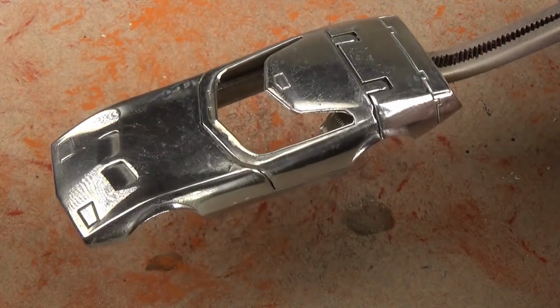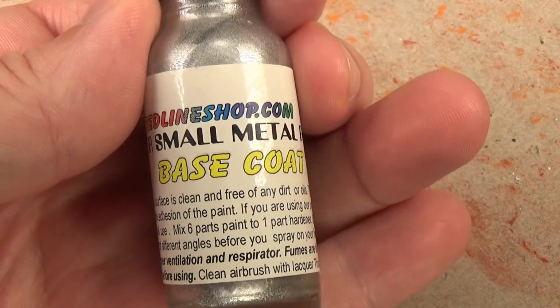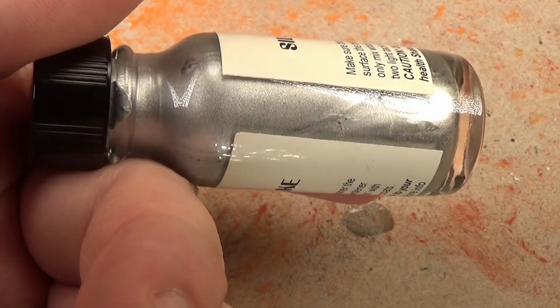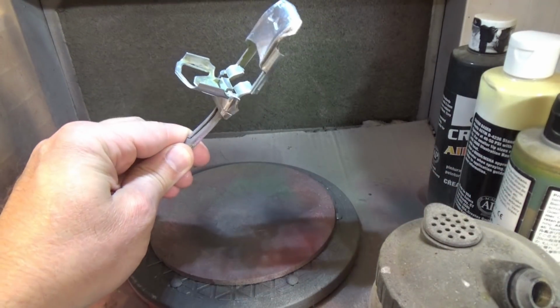After the steel wool, I'll move to a polishing wheel and some polishing compound to get as close to a mirror shine as I can get. Now it's time to start the new painting process. What I'll be doing is airbrushing on a super thin layer of this base coat metal flake sold by the Redline shop. I'll leave a link below. I'm only applying enough of the base coat to remove all the polishing scratches in the metal.